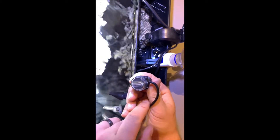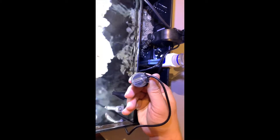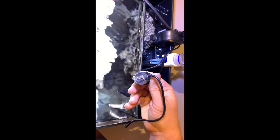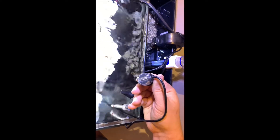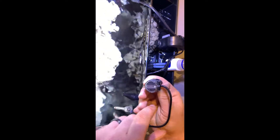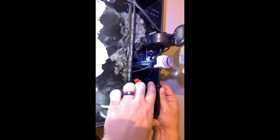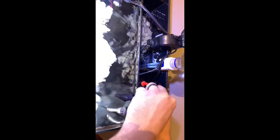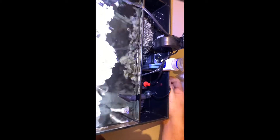The cord at the top is the top of the sensor — the top of the sensor is the auto-off, and the bottom of the sensor is the water shortage sensor. The low level sensing point is right towards the bottom of the black plastic piece. We're going to install the sensor straight up and down in our sump, positioned just a little bit higher than the current water level so you can see it when it turns on.